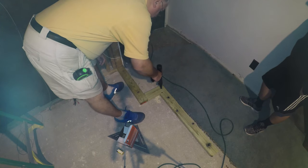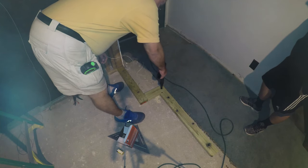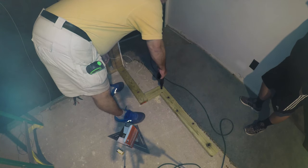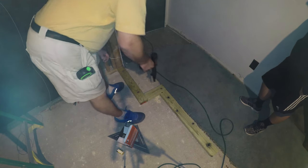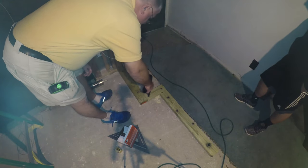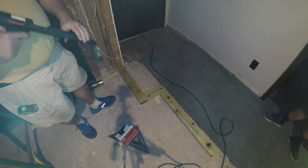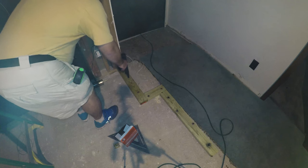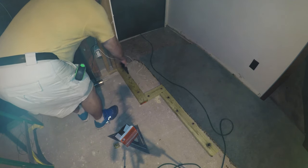You do have to be careful with your code because you may have a floating floor. You should use this method for the bottom plate, but then you may need a floating wall that does not come in contact directly with the bottom plate. In other words, the floor can float up and down as much as an inch to three inches.